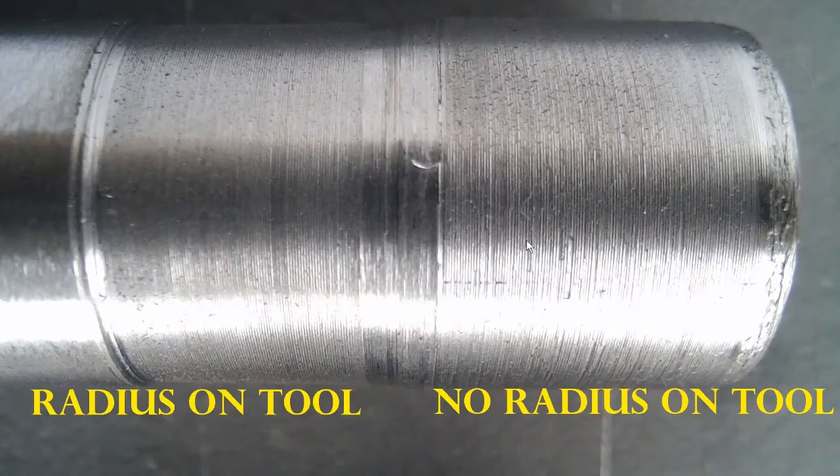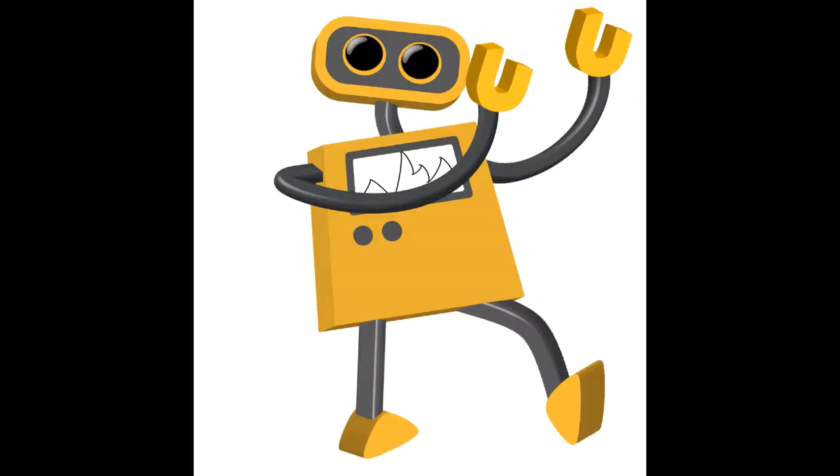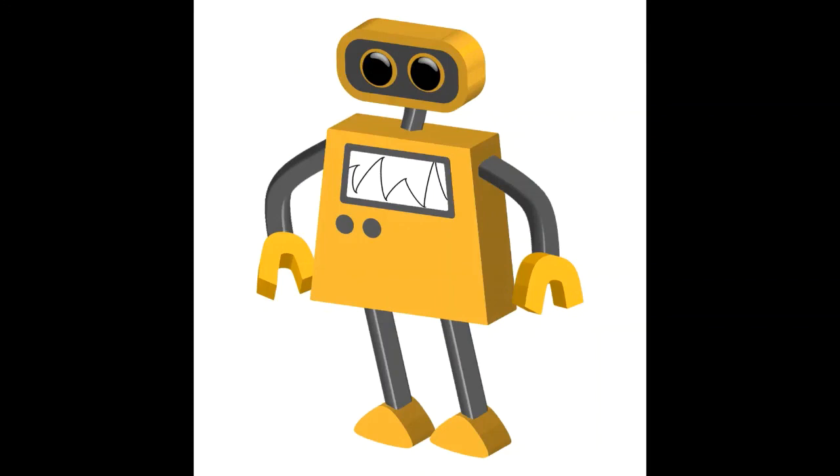I had put this in my electronic microscope that I made for my computer out of an old webcam — we will do a YouTube project on that at some point. Anyway, there was no radius on the tool that did this side, and you can see a lot of tearing went on over here. The other side could definitely be a lot smoother and would have been had I spent more time putting a smoother and a little bit larger radius on that tool bit. This is enough of a comparison from one side to the other to show what happens when you leave that sharp point — you're going to get some tearing and not so great a finish. That's it for now; if you'd like to be notified of other new videos, please click the subscribe button. Thanks for watching.